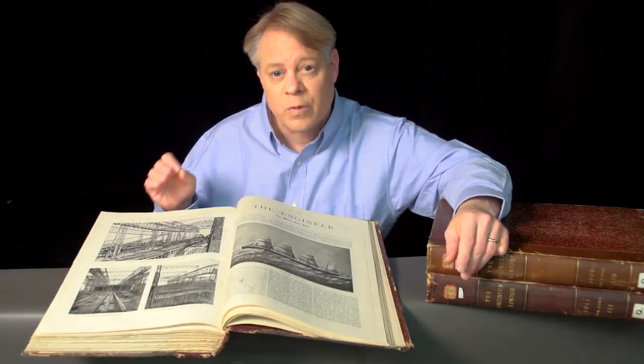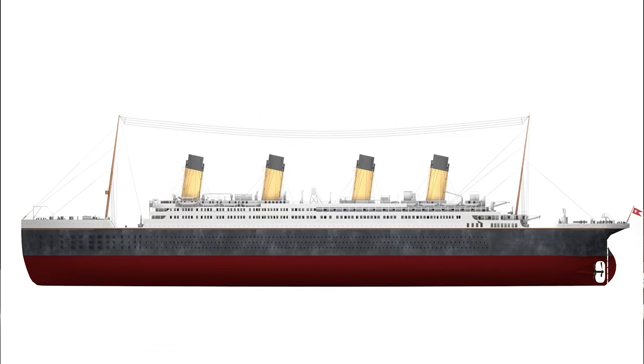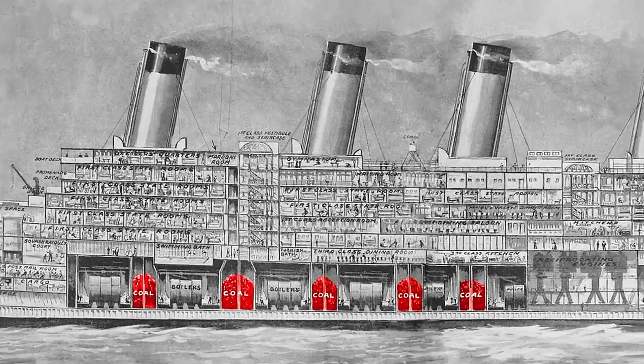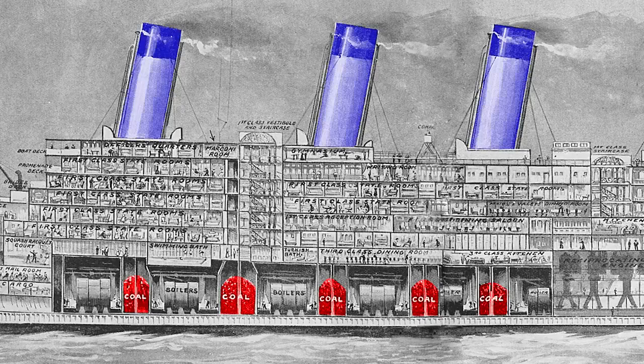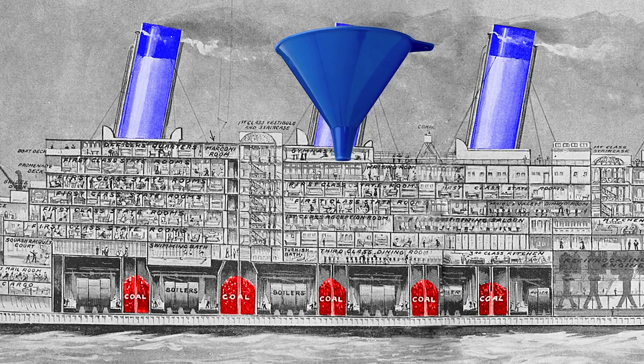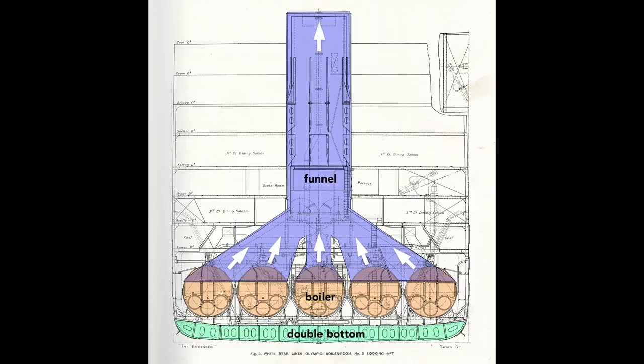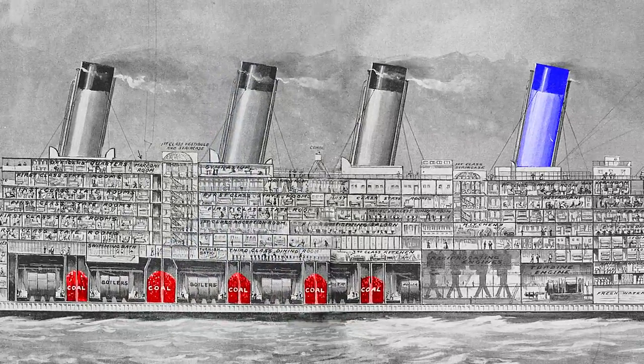Despite these accidents, the Olympic-class ships were great feats of design and workmanship. Just consider the propulsion system of the Titanic. The ship had two sets of reciprocating engines, fueled by coal which was stored along the bottom of the ship. Exhaust gases from the boiler discharge through these smokestacks, which are frequently called funnels — they are upside-down funnels. This cross-section of the Olympic shows the boilers sitting atop the double bottom. It's well known that the aft-most funnel on these ships is a dummy, built primarily for aesthetic reasons. Although it did not service the boilers, it was used as a ventilation and extraction shaft for the engine and turbine rooms.